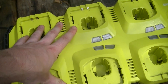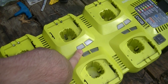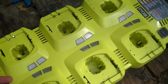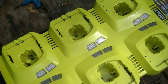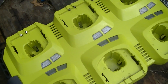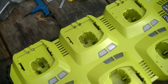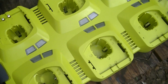If you have things where it's important to charge batteries in a certain order, that's where having individual chargers would be more important — especially the P118. It's the smaller of the two chargers and it's kind of a really dark charcoal gray, almost black color. Those are useful because they charge the batteries at a lower rate, so the batteries aren't being driven as hard and should last a bit longer. Because they use less power on an instantaneous basis, you can run more chargers for a given load, or for a limited-capacity solar system it doesn't place as much of an instantaneous drain, especially if you're simultaneously running stuff and charging your battery bank at the same time.